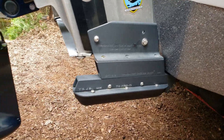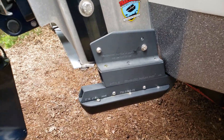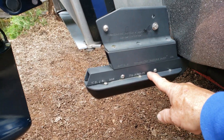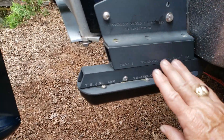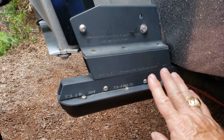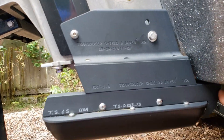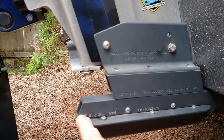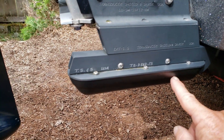This is the 3D structure scan transducer, mounted with a transducer shield and saver bracket — T6 aircraft aluminum, very strong. This is the most sturdy way to mount your transducers to get the best possible signal and protect that expensive transducer from damage. I've had this transducer since they first came out and it still works as good as the day it was new, because I invested a little extra money on a good bracket. It's got protection in the front nose so if you hit a stump it's still protected, and it's rigid aluminum all the way down so it doesn't flex and bend, which can break the transducer and the crystals in it.